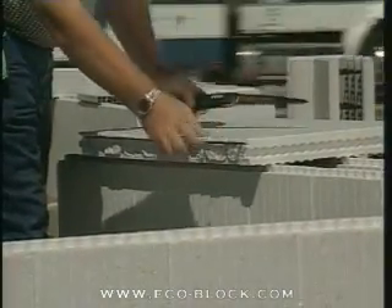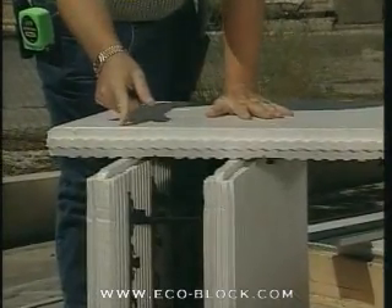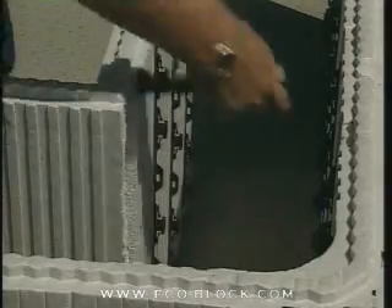Clean the cut up with a saw if necessary. On the inside pieces, count over six bars and cut. Set the panels in place, set the connectors, and slide in the 90-degree corner bracket.